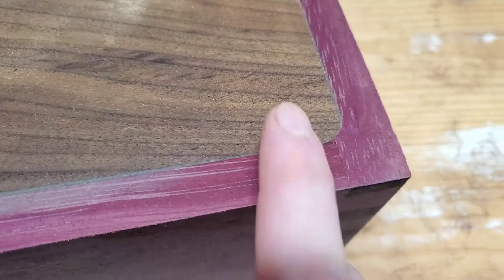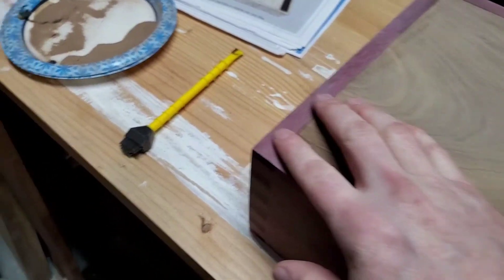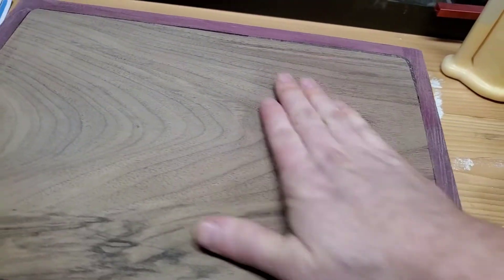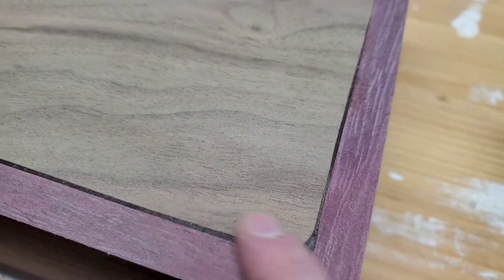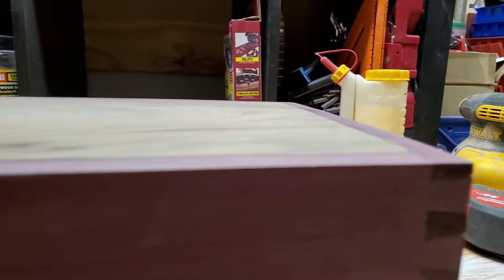That's the best corner right there. After putting on the third coat of filling into the cracks and sanding with 80 grit sandpaper, I'm going to slowly escalate up to 120 and then to 220. Everything is sealed — no spaces, no holes, no indents. Everything is sealed, smooth, and ready.